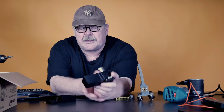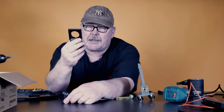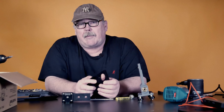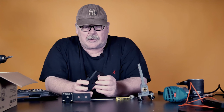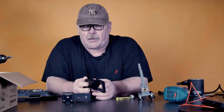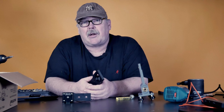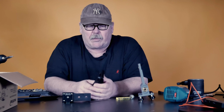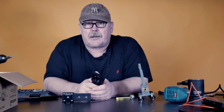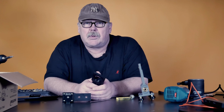And here you see the engine mount for the stepper mount, and you can also see here, it's absolutely gorgeous. I had to redesign it again because I need a bigger stepper motor. It was too tough for the NEMA 17 stepper motor to run on the rails. So this is now the upgraded version I have made, and now I'm waiting for the parts and see how this will work with my steppers. So let's go to the computer and take a look on Craftware, and I will show you how easy it is to use.